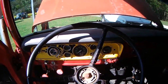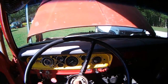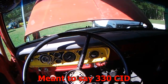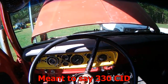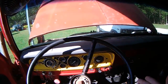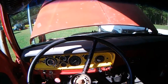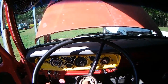It's a cold-natured motor, but it is a good running motor — it's a built motor. I think it was 2008. The original motor in this truck was a 303 cubic inch and the block cracked on it; it was wore out. I had a local machine shop build this motor — it's a 352 cubic inch short stroke big bore. This motor builds torque. You can pull this truck about 24,000 pounds to the mill, no problem. That old motor was struggling.